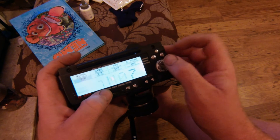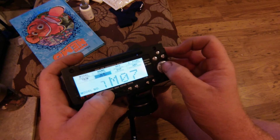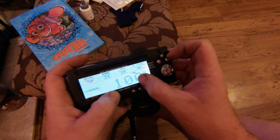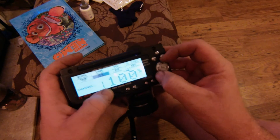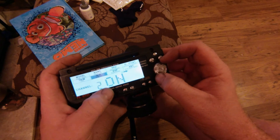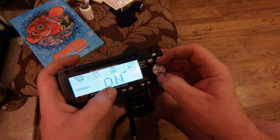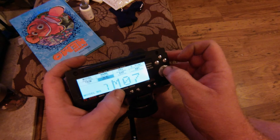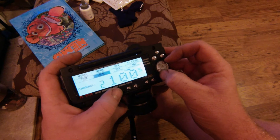I've also found you can set the dual rates on them as well. If you hold the switch down again it'll go into the sub dual-rates menu for channel one — which is your steering — then channel two. You can also change the dual rates on channel three, because in your normal dual rates menu you can only do channels one and two.